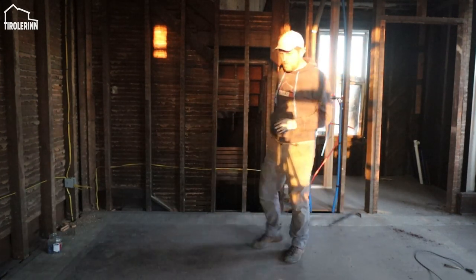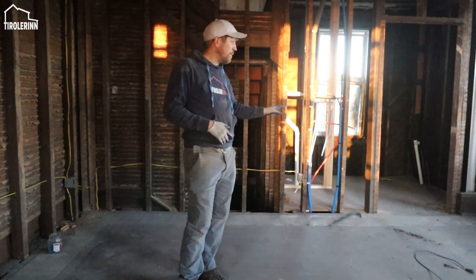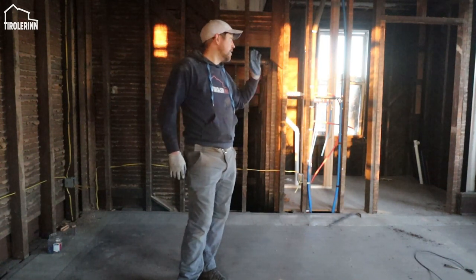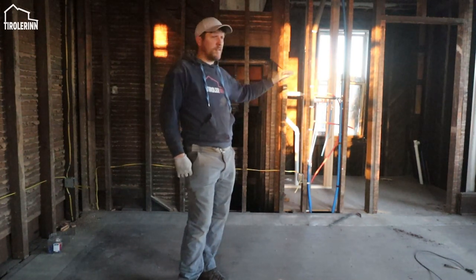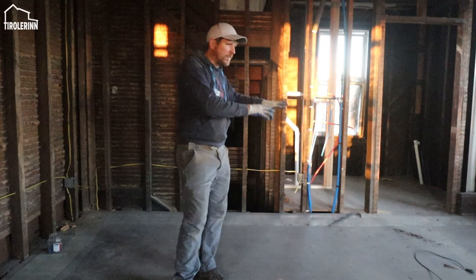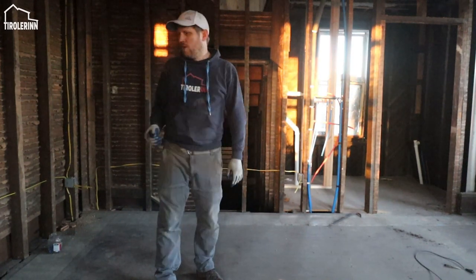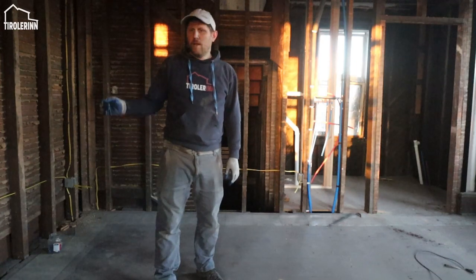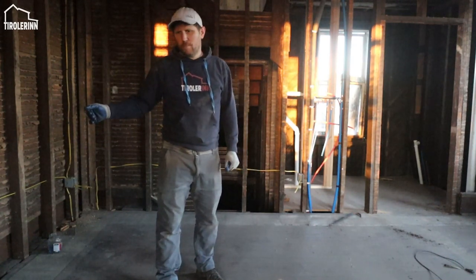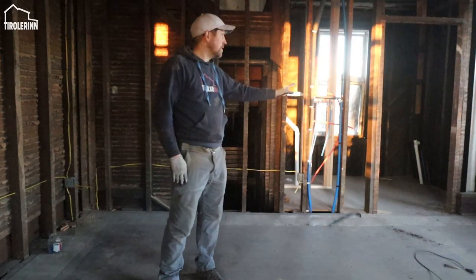Yes, I'm actually combining the bathroom and the guest room in this room. First of all, we don't use it as much, and second of all, it's only 2 receptacles in the entire bathroom itself. And obviously, the receptacles for the bathroom are going to be GFI protected. So the first receptacle right below the mirror obviously has that protection, which then puts it in series with the extra one, and the rest of the room will be beforehand, so therefore is not GFI protected. Obviously, you don't want to accidentally have the GFI trip based on doing something in the bedroom and then having to go into the bathroom to flip the switch on the GFI. So obviously one circuit, but GFI only for the bathroom.